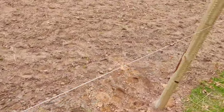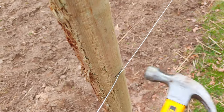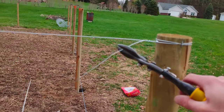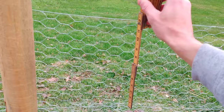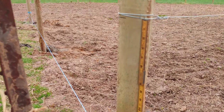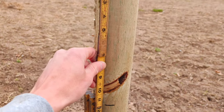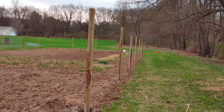Now we've got a straight, tight wire across the top of where the fence is going to go. Go back through and finish off all the poultry staples. The distance between the wire and the poultry netting is about 12 inches, so we're going to put marks at 12 inches below the wire we just set. Because of the size fence I'm using, we're going to have to do this two or three more times depending on the elevation. Once all the marks are set, we're going to repeat the process that we did for the first wire.